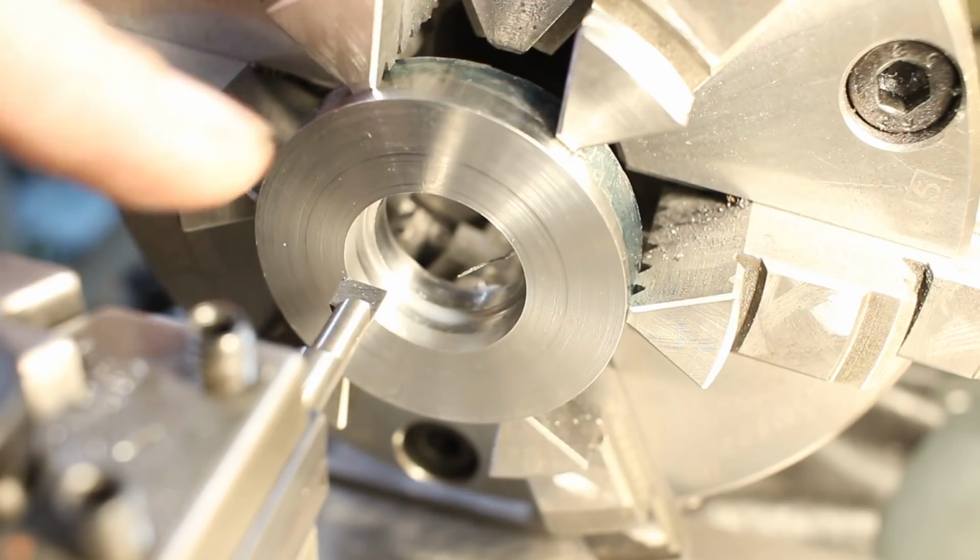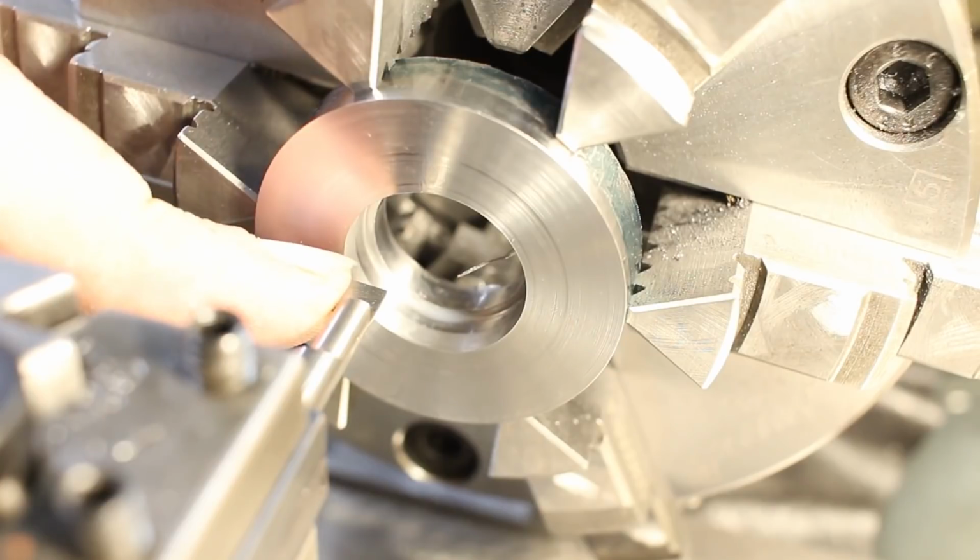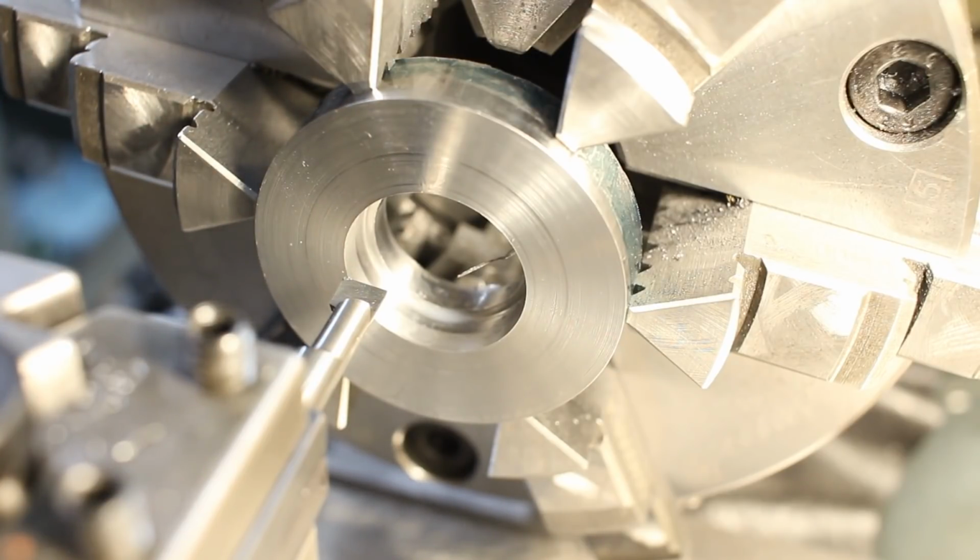Robin showed on Instagram a version of these that have a helical grind, and I might try to figure out how to grind them yourself using either the bit grinder or tool and cutter grinder. They have the benefit to have a positive rake, highly positive front rake, and you also grind them only on the front face. So they should cut even freer than this one, and should be possible to grind them yourself from solid. But I have to figure out the geometry in CAD before that.